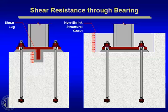What we've normally done is just bite the bullet and design the anchor rods for that shear in a shear friction phenomenon and use really heavy anchor rods as opposed to going to these lugs. Obviously, there's ample opportunity for a concrete contractor to screw that up, right? And also for the weld to the bottom of the base plate to be no good.